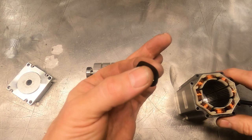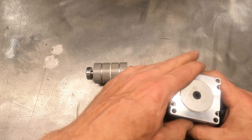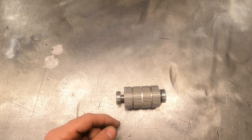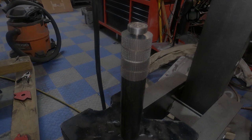We put the spring washers back in, put the cap back on, and set that aside. The repair plan is a two-phase thing: first see if we can press the shaft out, then press it through the bearing and the whole body. Then we'll turn down a new shaft of the correct diameter and press that right back in. Let's get this set up in the press.